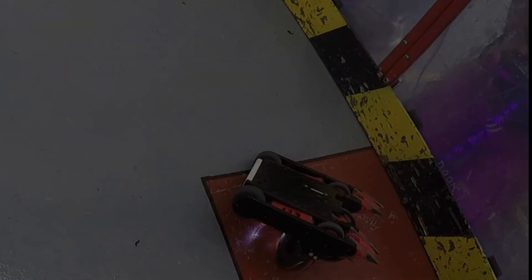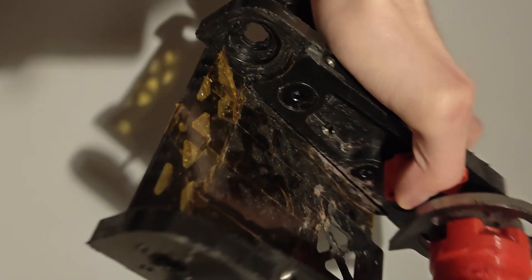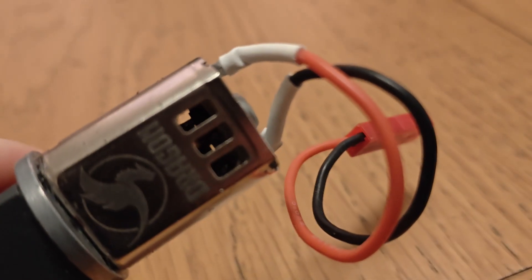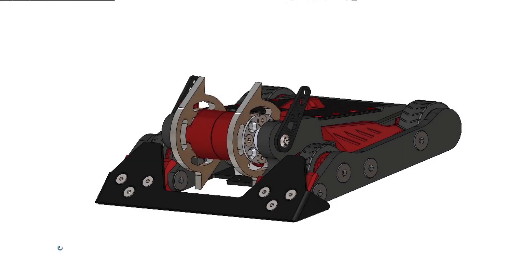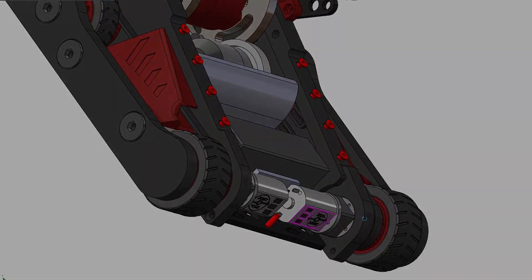There were also some less obvious problems that came to light after the fight. Something I thought would be an excellent design decision turned out to be terrible — I'd added cut-outs underneath the drive motors to help them stay cool and circulate air. Unfortunately this allowed debris from the arena to get sucked up into the drive motors, shorting one out. I could quickly fix this with a bit of Kapton tape over those vents. The process of replacing the motor revealed problem number 2: this thing is an absolute nightmare to work on. To replace the faulty drive motor I had to remove 14 fasteners, a side armour panel, top armour panel, a wheel, a drive belt, and then a 15th fastener I'd completely forgotten about, before finally removing the motor cover.